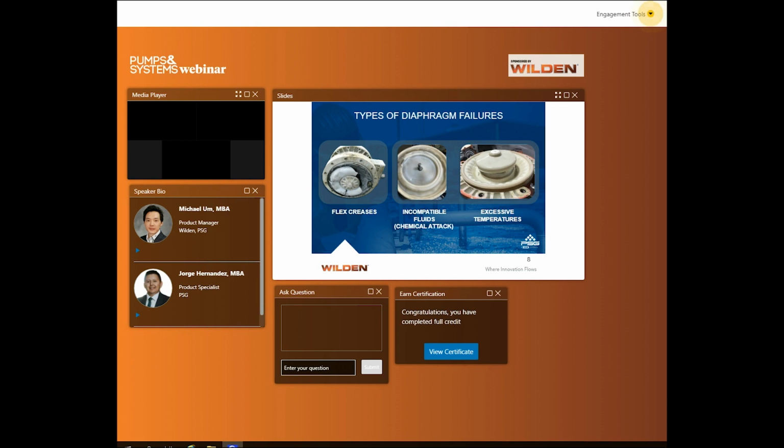It is important to note that chem guides do not list all types of media, and if you find that your media is not listed, then I would encourage you to look at the containers the media is stored in, or the hose used to empty containers, for example, to make an educated decision on a matching diaphragm material type to your media.